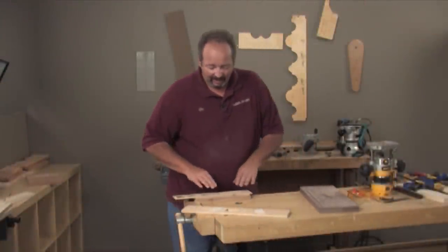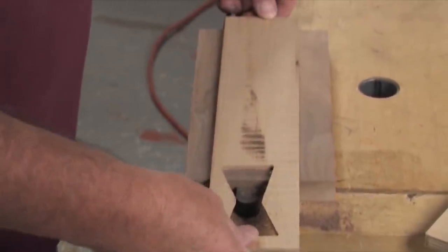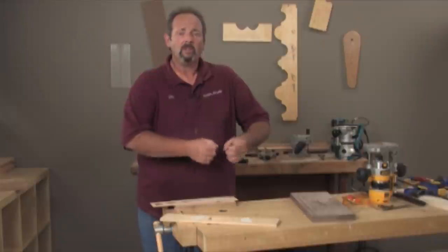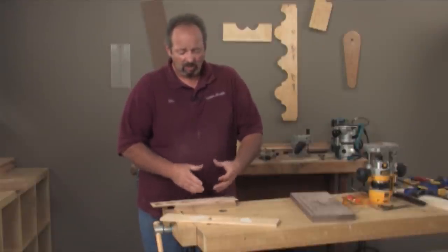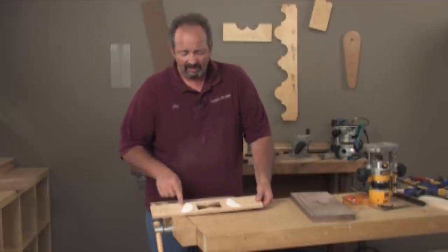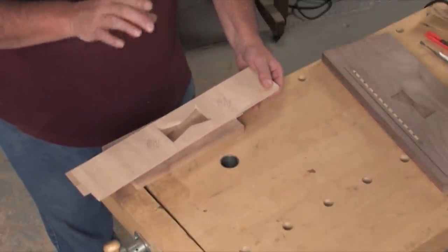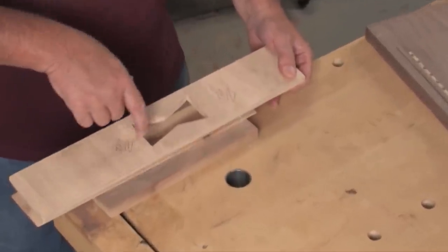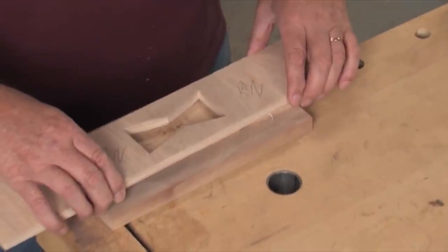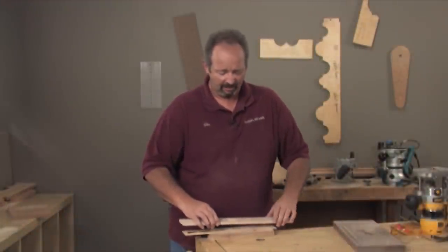We're going to push this aside. What I've got set up here is a sacrificial piece — I'm just going to route into it; I don't want to route into my bench. This is the actual piece we're going to inlay. Notice I can't lift it up — I have double-stick tape on it. I've stuck this down to the work surface, because when you cut this free, it's going to be floating, and you don't want it moving around and hitting the router bit. I've also added a couple pieces of double-stick tape so I can position the pattern on top. Here's a note: notice I've got 'top' written on my pattern. Every time you route this pattern, make sure that top is up — it was up when we worked over here, and we want it up when working on the inlay piece. If you turn it around you'll get slightly different shapes unless your pattern is perfectly symmetrical, so it's easier just to keep the orientation the same.